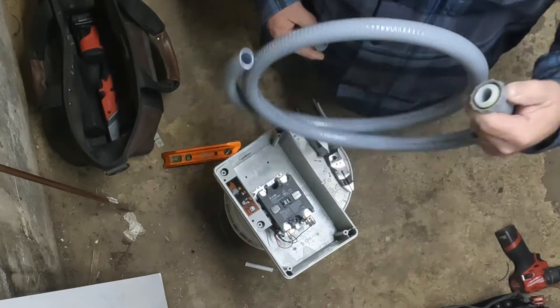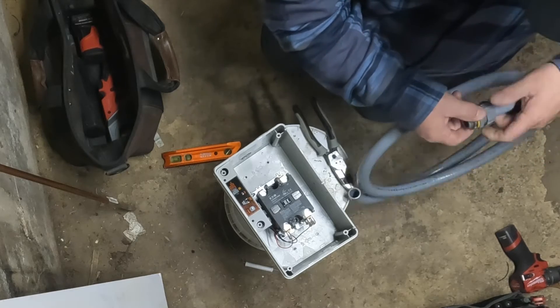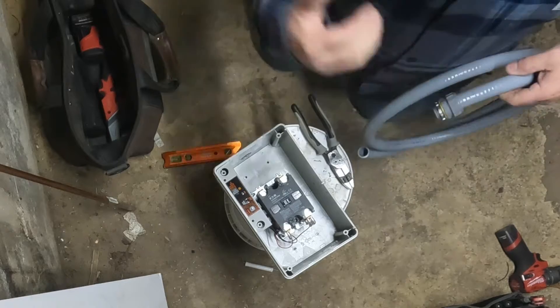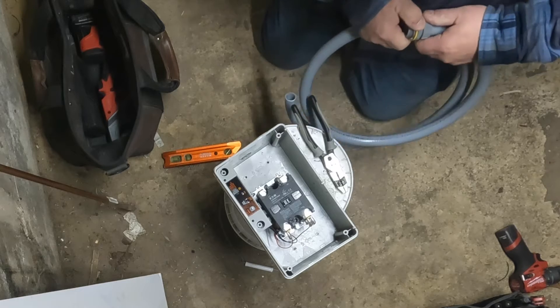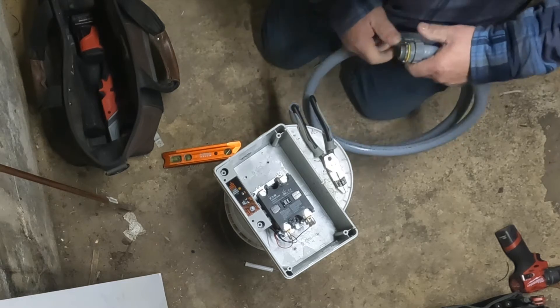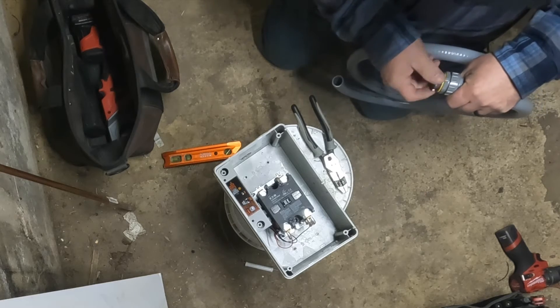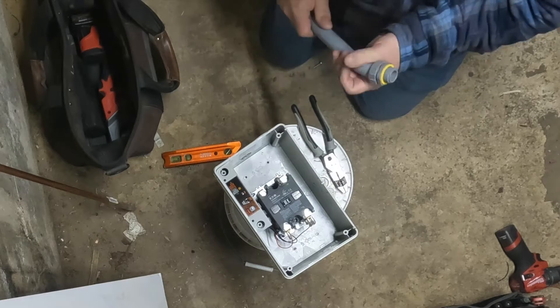See that? That's water tight. Then you tighten these two pieces together. This area here is just weather tight — it doesn't really need to be weather tight here since we're not in a damp or wet location. There's a finished basement, but I put these in for flexibility, and because the other smart manage module I have there is also done with this flex.